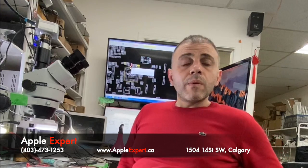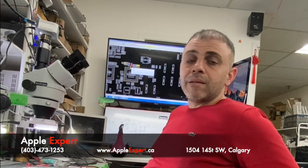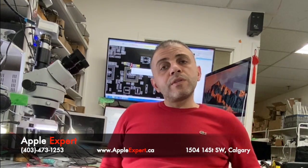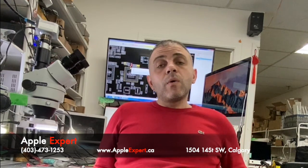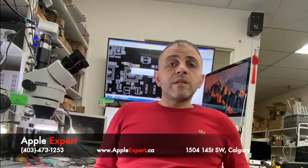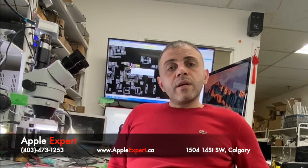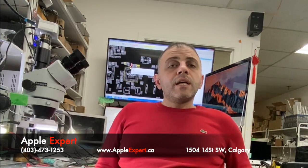So when the customer walked in our store, we took the board right in front of him. We saw the liquid on the board. We showed him, and we told him we'll get back to him. It is repairable. We started removing all the corroded chips around the USB-C controller. We removed all of them. We lost one pad on the board. We ignored it because we were not sure where it's connected, as it doesn't show on the board view or schematic. Then after changing all the chips, we ultrasonically cleaned the logic board.